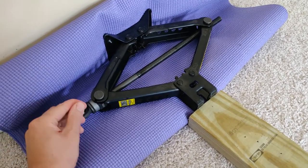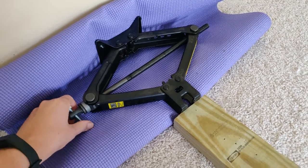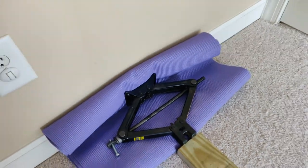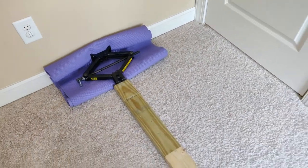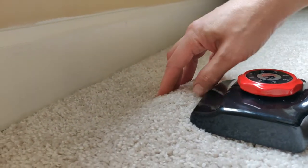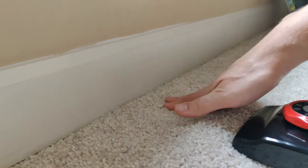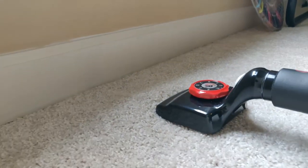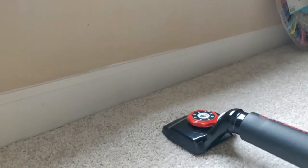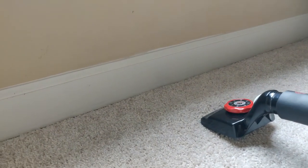You're going to get a lot of torque out of this car jack — it's designed to pick up cars, so it's got more than enough strength to push a carpet. I was able to get about an inch of rise just from using the car jack, and you can get much more. I didn't want to pull the carpet too much since I've already installed it, but that is how you make a homemade DIY carpet stretcher.